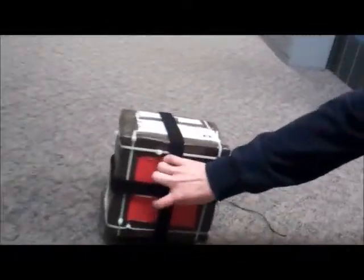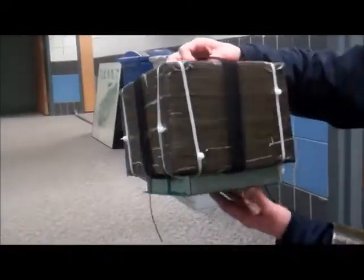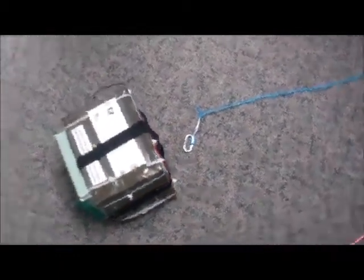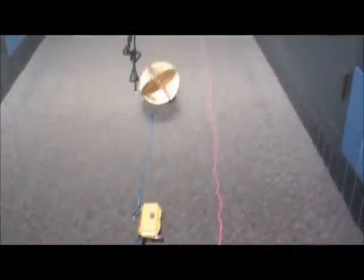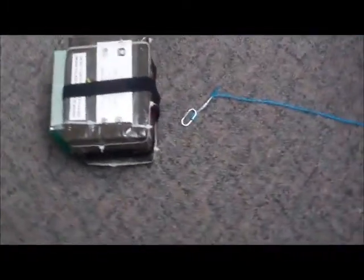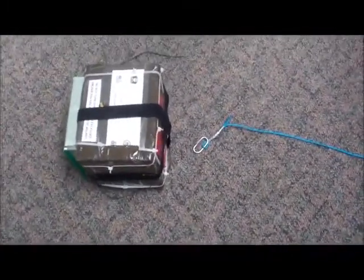This second tracker works in a similar way — we built it ourselves. It has an antenna on the bottom that also works in a similar way, with the same radiation pattern, but we designed it so that the null is very small, so we get as much coverage as we possibly can. Now that we have all of our packages lined up in the order they will be attached to the balloon, we can go ahead and attach each package with the pre-made rigging lines from the previous video.